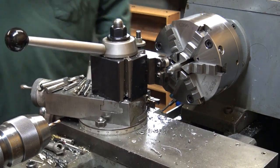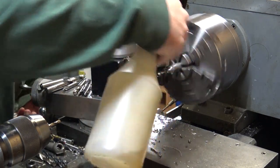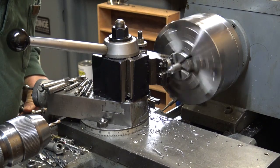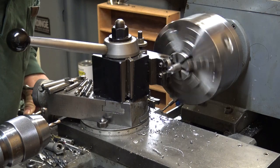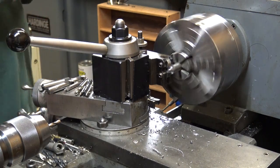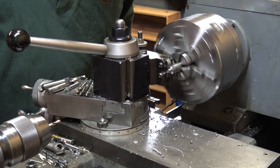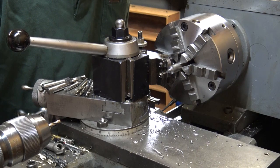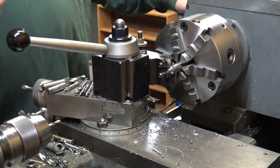It's just like cutting gears. 40 lines per inch. You sit down and do the math if it's critical on the dimensions you're trying to keep. But most of the time when I do a knurl, I just look and see if everything's lining up in the knurls after they make a complete turn. They're laying back into the same grooves. If they aren't, I just skim 5/1000ths off.